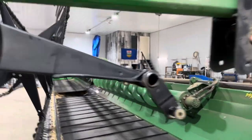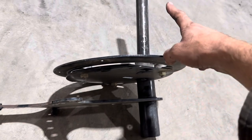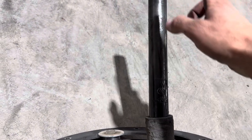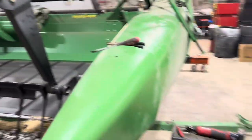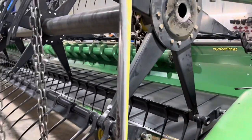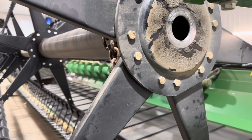We just took the end off, moved the reel, pulled the reel a little bit that way, slid that collar out of there — that slid out easy — and then we took the shaft to the press and pushed it out. Making sure, because this is all rough and gouged, we didn't want to push it that way. So we pushed it through and only had to get it started; we were able to pull it right out. That is the shaft hooked to the shaft that's broken. We just found that shaft is a day or two away and it's $930. So we're going to pull this plate off, see how bad it is, pull that whole thing out of there, and then we can either try to weld it or get a new shaft.